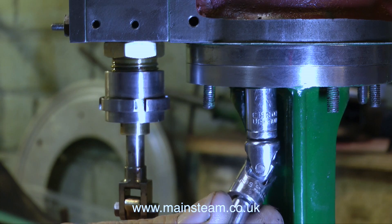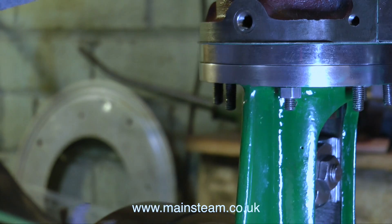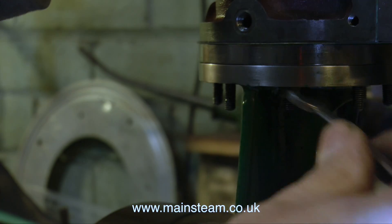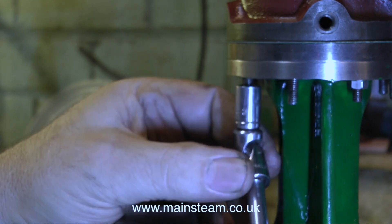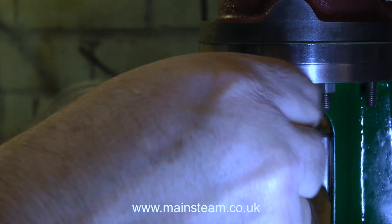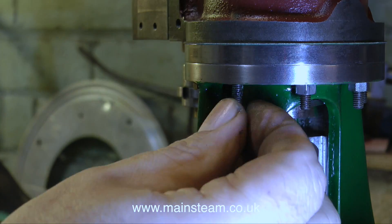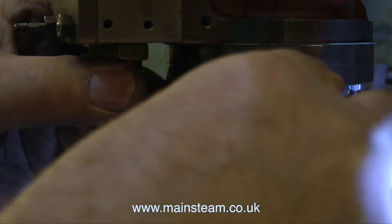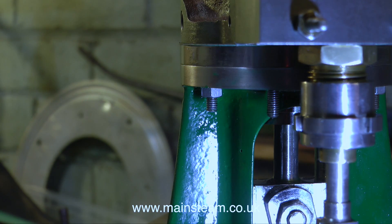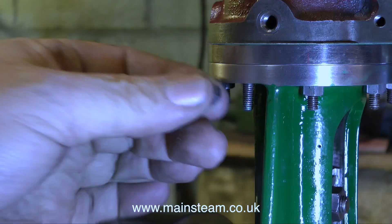For this next job, you need to be tooled up — you need some specialist tooling. I'm using a small spanner here to illustrate how fiddly and how long it would have taken, and I cannot use my adjustable spanner here, there's no room to swing it. The small spanner's okay for the final tightening, because you can get a better feel on the spanner as to how tight the nuts are on the studs. Even though this is a big engine, classed as a small full-size engine, these 2BA studs are still only 3/16ths of an inch in diameter, so too much pressure on the nut will shear them off, and you really don't want to do that, because it means taking the cylinder off and repeating the process. I could spin some of these 2BA nuts up the studs manually, others required the socket, and I really did find this universal joint socket very useful.